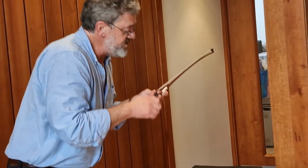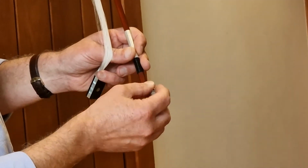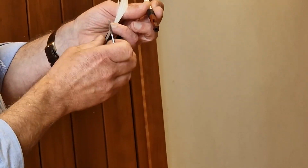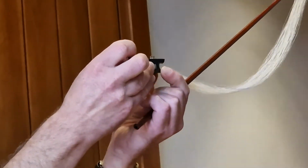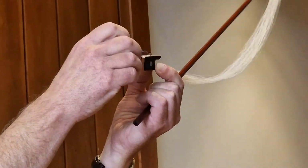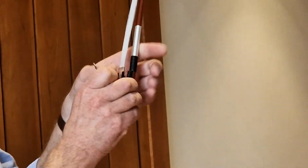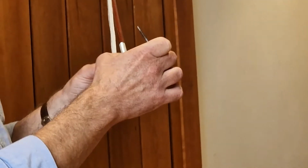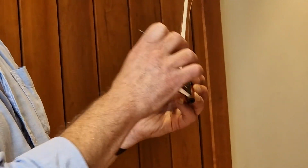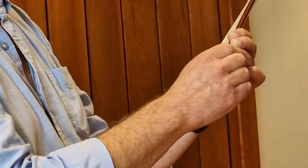Let me just stand up to show you that. So you've got a hole well up through the stick here. You've got a mortise here. You've got another hole in here. You've got a bronze eyelet here that the screw goes into. It's such a simple thing. Tourte did this, or people around his time, but I think mainly him. Before that, they had a system of clipping a frog onto a stick. So you could pick different lengths, but you couldn't really vary it. And he came up with this simple thing.